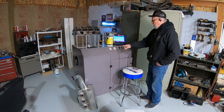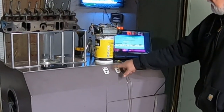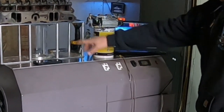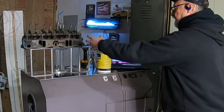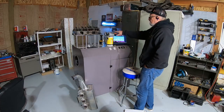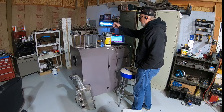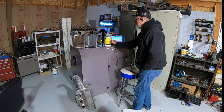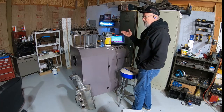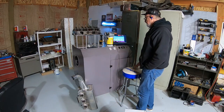I have two switches: I and E — intake and exhaust. I have it on exhaust right now, which means the air comes up through here and out, instead of pulling air in. I would switch to intake when testing an intake port because the air is being pulled up through here. I also made a simple adapter so I can turn the carburetor around and test it on exhaust mode — blowing air down through it instead of sucking — and we'll do another video comparing those two methods.